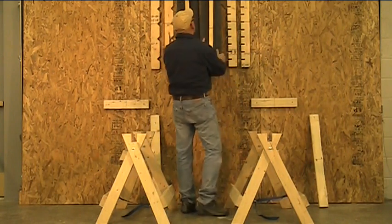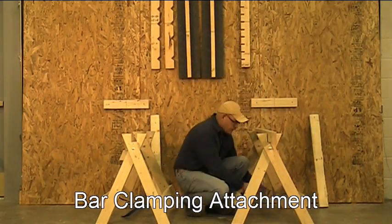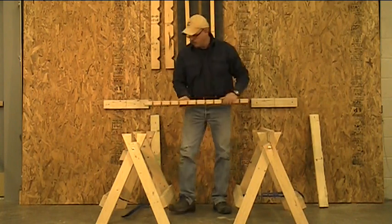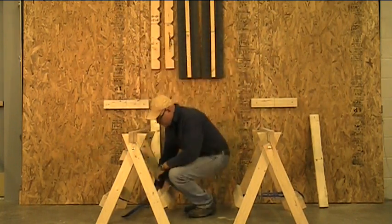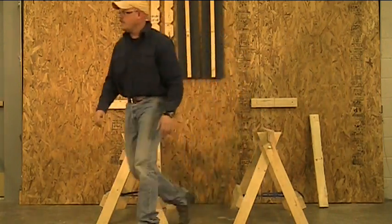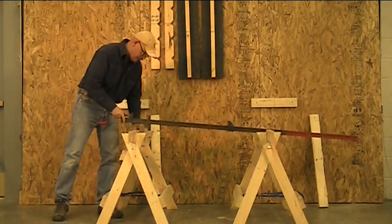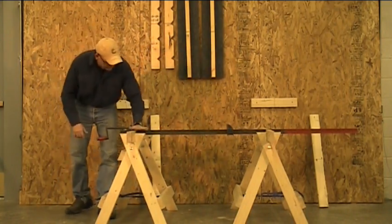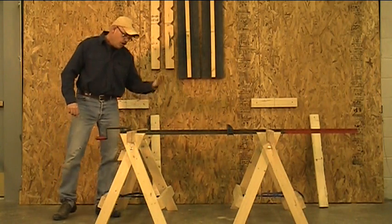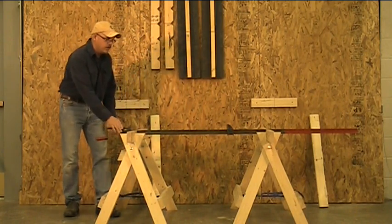I have a couple other attachments I came up with, and I'm sure you can figure out some that will work for you. I have some large bar clamps that I use for panel clamping, but I find that the clamps roll around and flip over right when you're going to clamp up your project. So with these supports, I've cut some dados in them, and by using large clamps, I can place them in the Shop Dog with the clamps situated above the support so I can clamp up my project however wide or long it is. All the glue falls to the ground but not onto my nice workbench, and they stay supported without tipping over.